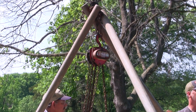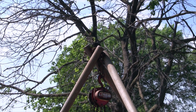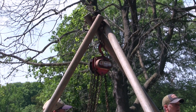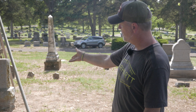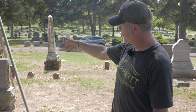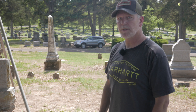These setups are common with preservation professionals and with NCPT — the National Center of Preservation Technology and Training — who investigate best practices for these types of things and are always in the field with these tripods. Once the stone is lifted, place it off to the side, pick up the next stone, set it aside, level the base, replace the stones in a level condition, and you're finished. It's as simple as that.